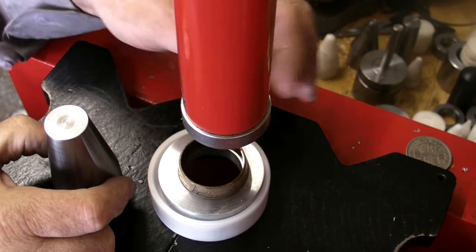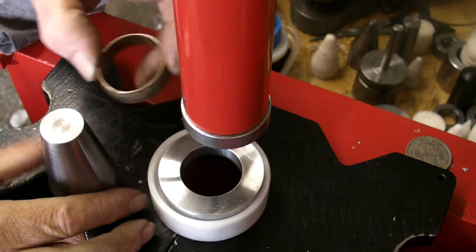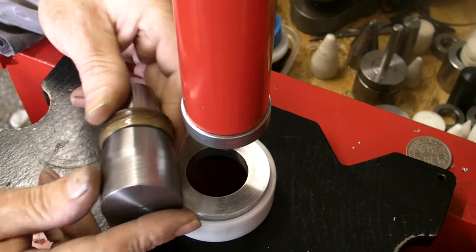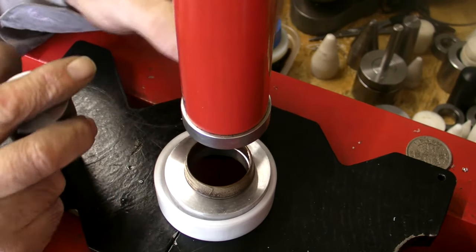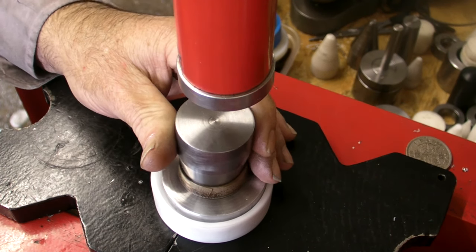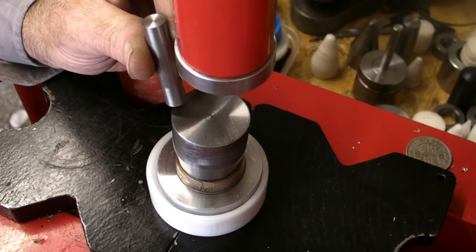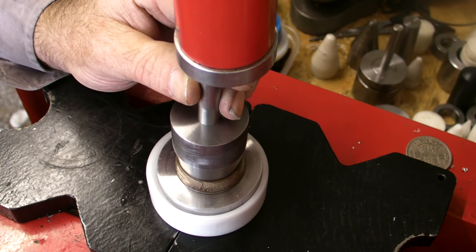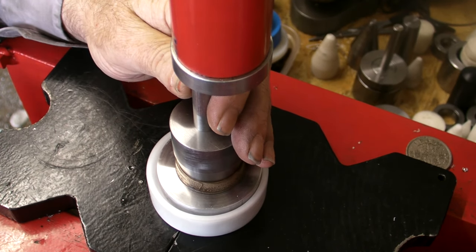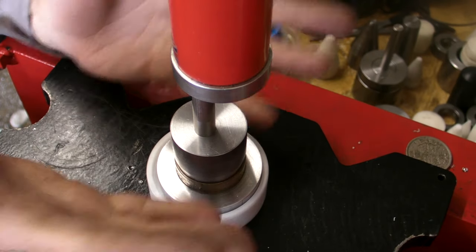Cone number three. Remember, it's always cone number two spacer to start you off before you go on to the in-between spacers. Same again with the angle. See how much you've gained without bringing the walls out at a rate that the ring just can't take. And that doesn't mean you ain't going to split anything, because this is asking a coin that was never ever designed for such a job. The way the walls come out very, very gently, instead of bang, in, split.